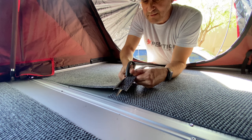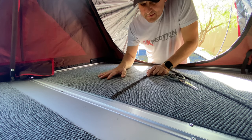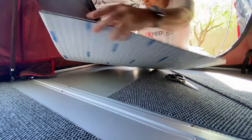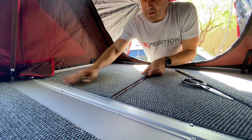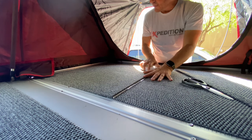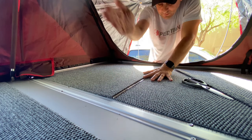I'm cutting off a strip because of the overlap. Even though this carpet is not supposed to fray, because I'm cutting it, I'm going to take the cut side, flip it around, and stick it up over on the edge so I don't have to worry about it catching on anything. I cut a little bit off this one, then cut the rest off the other one, flip it around and lay them down. They'll be down nice and solid and the seam will remain right down the middle, which is what I want.